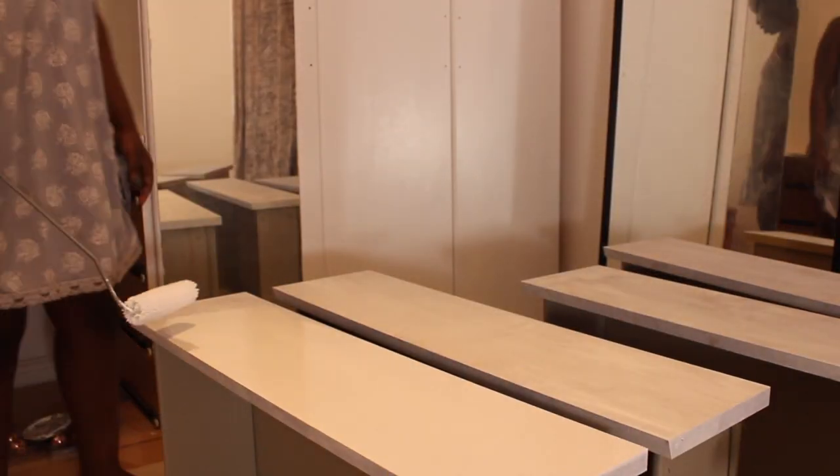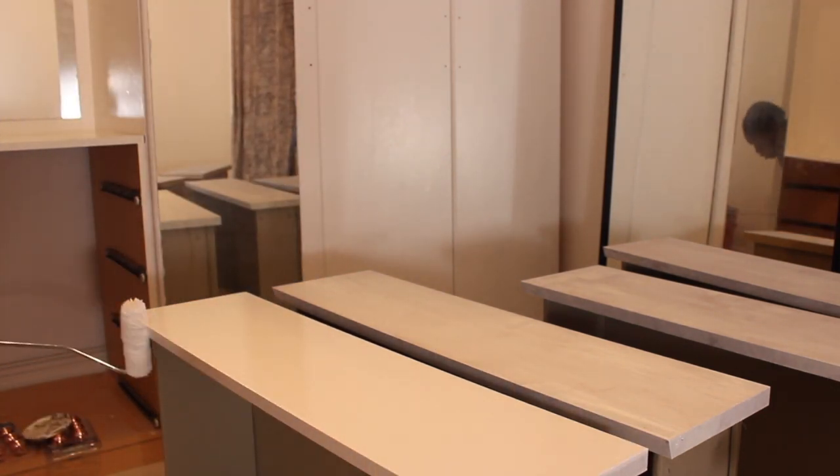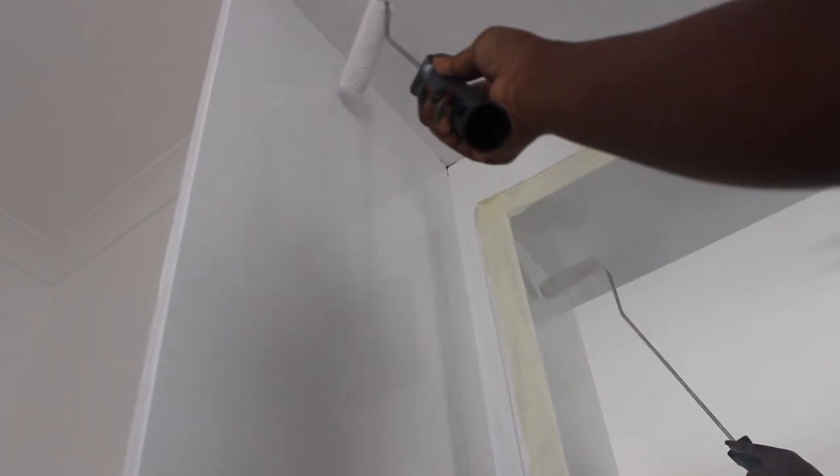Can you see how handy and quick this rolling paintbrush is? It's amazing — it ensures you're not going to get any drip onto the floor, and it was very therapeutic. Don't forget to go in with a paintbrush into all the corners and nooks and crannies. Don't overload your brush with too much paint. One coat of paint should be fine, but if it's patchy you can go back in — just make sure you wait for the paint to dry as suggested on the packaging.